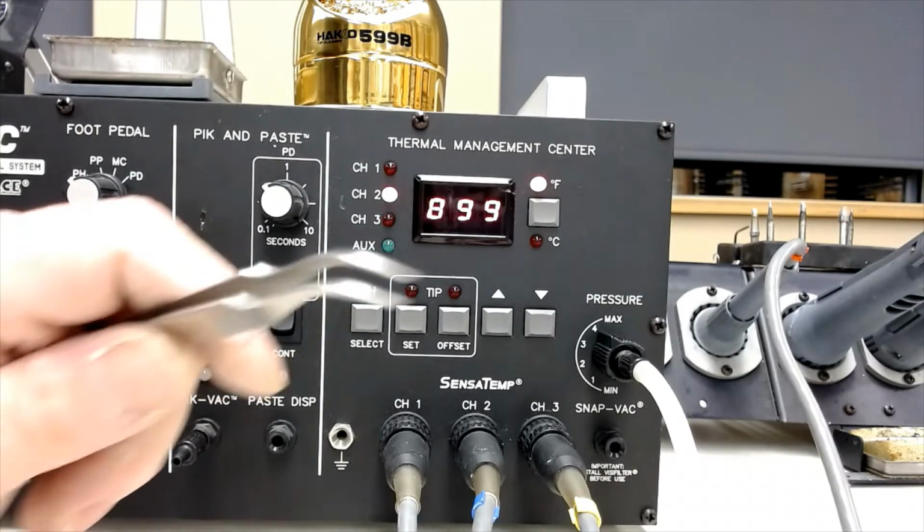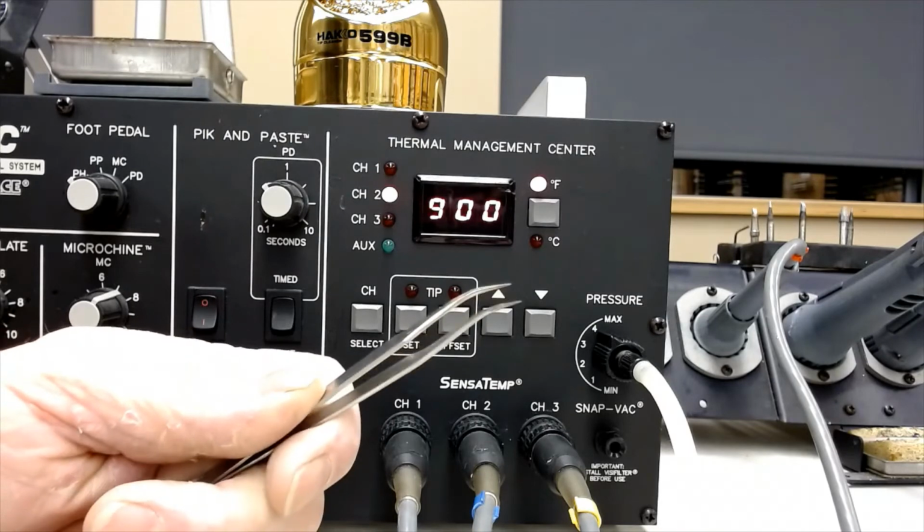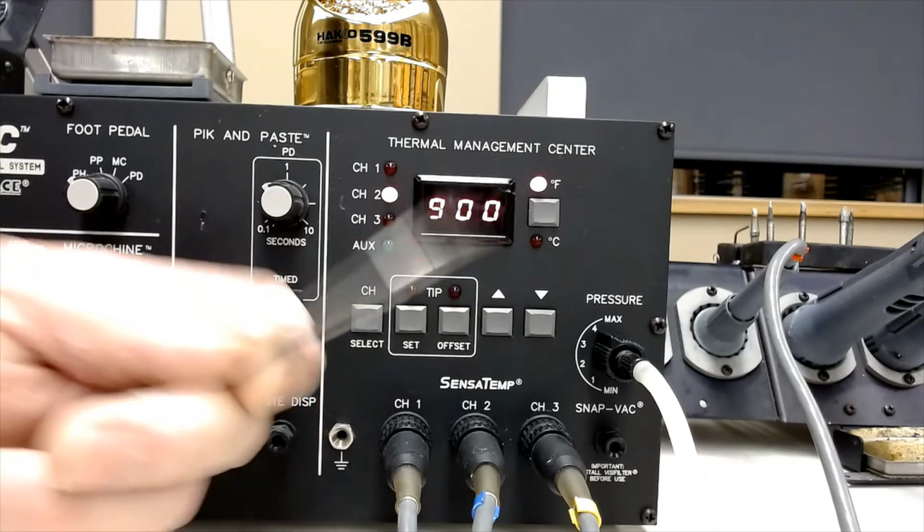The other thing that should be in your kit is a nice pair of fine tweezers. These are really small, and the ends should come together nice and tightly. Don't bend those. These are really good for picking up parts. So that's in the kit. When we've been soldering before, you've been using this through-hole solder, which is pretty thick stuff. For surface mount, we're going to use this other stuff, which is significantly thinner. So look in the kits. There are going to be kits on the desks when you show up. Look in the kits for this thin solder. With this thick stuff, you just touch it with the iron and you'll have a big lump of solder on these surface mount parts. This stuff feeds out a lot better.